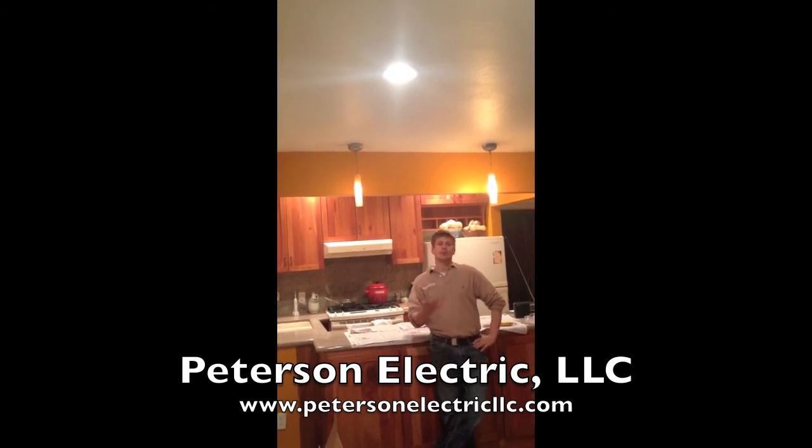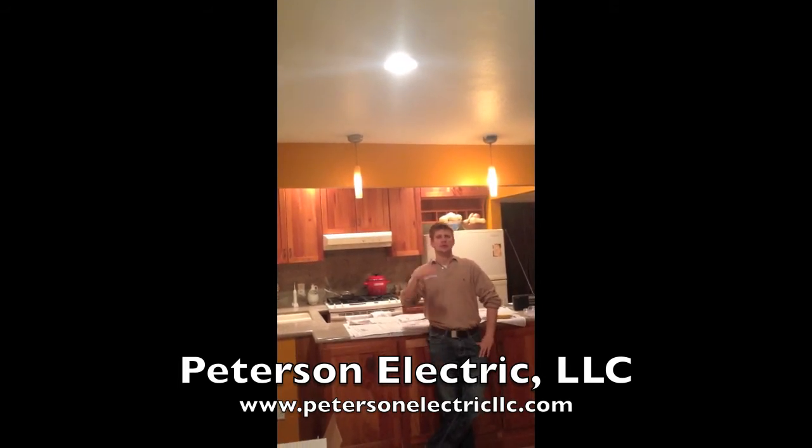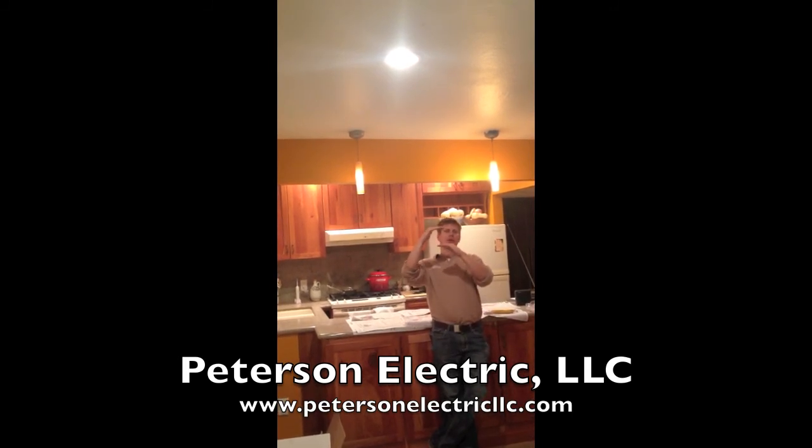A little bit of a surprise on this one. Normally we can hit the bids straight on with stuff like this, but without that attic access you're just not sure what you're getting into. Newer homes with two stories aren't as bad — anything from the 80s and on would be fine. But some of the homes in Washington Park from the 1930s, 1920s, or 1910s sometimes even have thinner than a two-by-six to support the joists, and you can't really get a full seven-inch can inside of there.